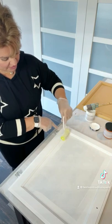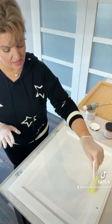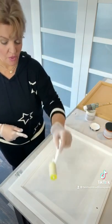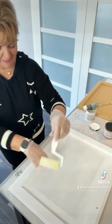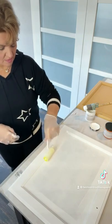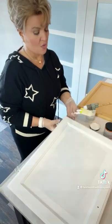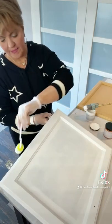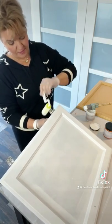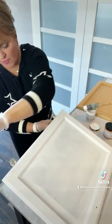This is where the brush will try to offload and make a little pull or run. If this door was hanging still — which is the way I prefer to paint doors — you might get a little run here. So if you turn your roller to the side, just roll right back into this area. That way, when we go over this in a minute, none of that will matter. Go around the edges, roll all of that, and make sure you've caught all the runs. If your hinges are still on, paint up to them as close as you can, then take your artist brush and paint around them.